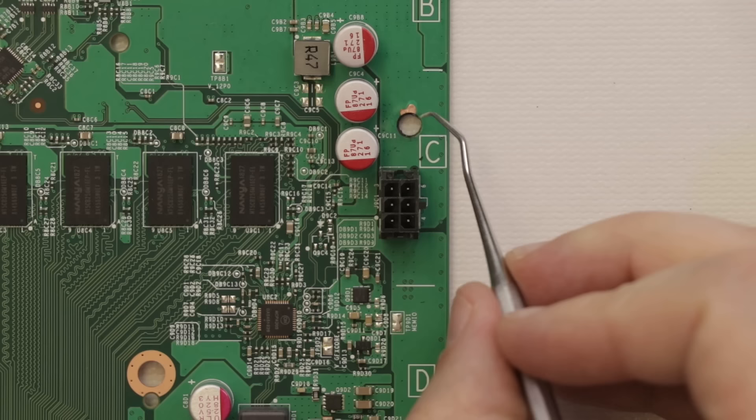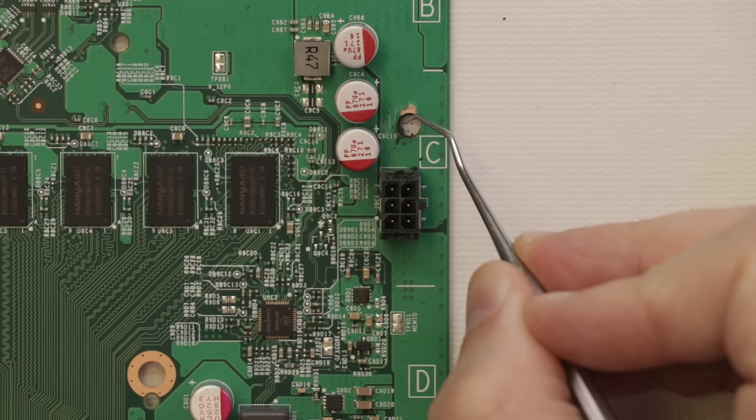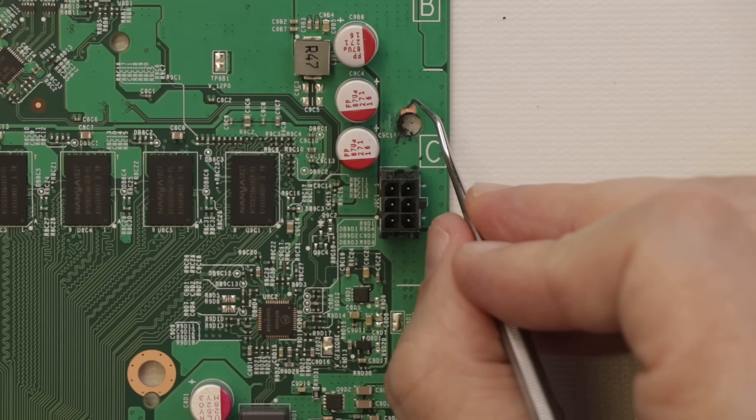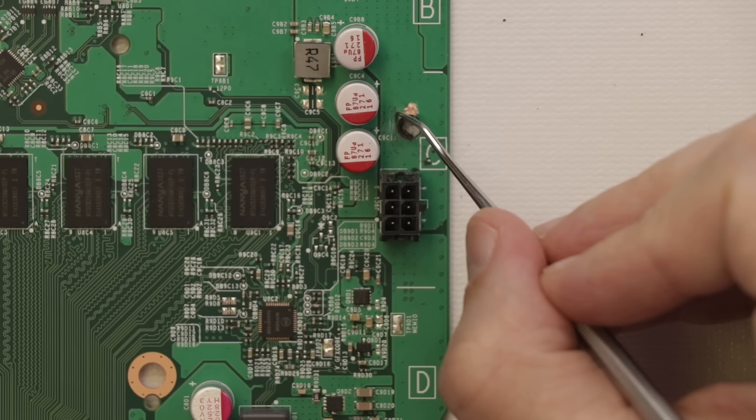All of this black right here — look at how black that is. I feel like it's coming from the layers down in here. So I think the problem is right here and not in the power supply, which would be why the power supply was disconnected. I'm guessing there's some sort of short right here. I need to get my meter out to check if there are pins here that are shorted out.